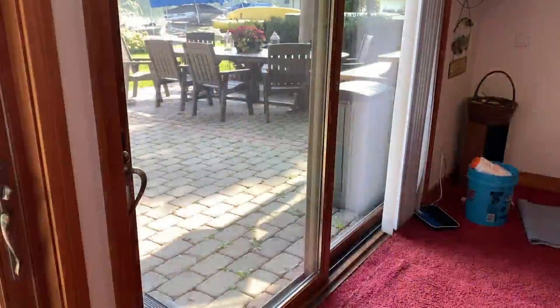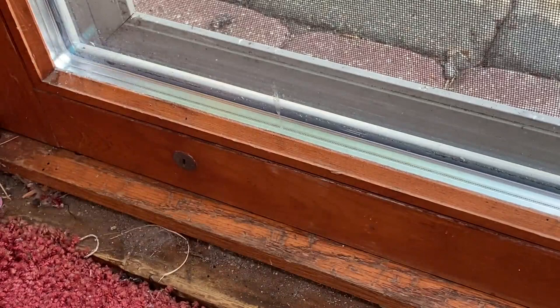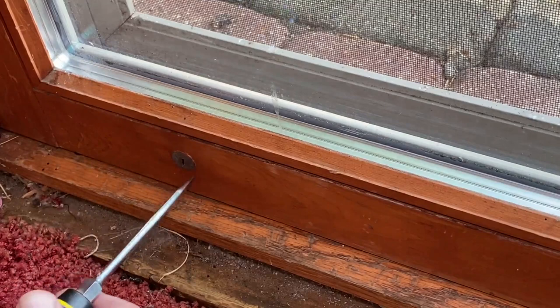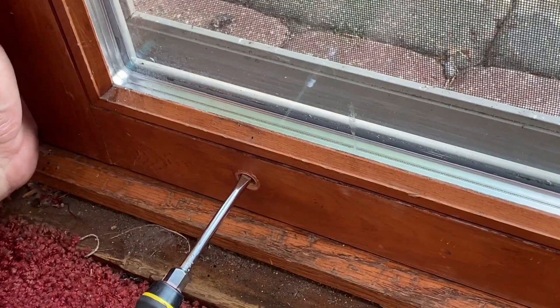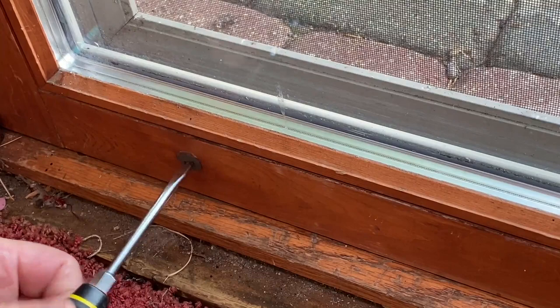I get this question all the time about sliding glass doors. People think they've got to replace their sliding glass doors because they get really stuck and you can't move them. It's really a simple fix. Most sliding glass doors on the bottom have two little tabs — you can remove a cap with a screwdriver, or sometimes take a little knife to pop it off. The door sinks and gets stuck against the bottom, but there are rollers you can adjust. You pop the cap off, and underneath there's an adjustment for the wheel. Open the door a little bit, put the screwdriver in, turn it to the right — it pulls the door up, and look at how easily you can slide it. It is that simple. There's two of them, one on each side. Put the cap back on and you're done.